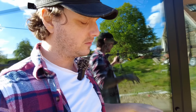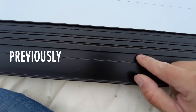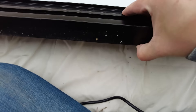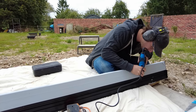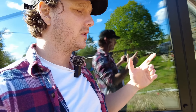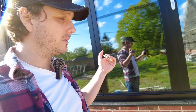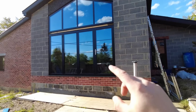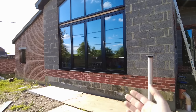I had to adapt the actual seal itself and make these little slots to get the water through. It's like a T-shape — the water goes into here and needs to get over to the other side, so I had to make holes or slots across. That was my fix; otherwise the water would have just got trapped inside. If you are ordering doors in the future, I'd say it's better to get ones that open out rather than in — then you don't risk any water damage. The only reason I got these opening in is because we're having a decking area here.